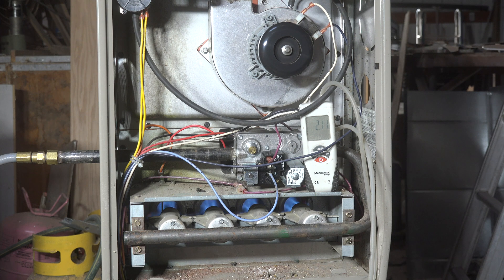If you look close there, you can see we're at about 2.10 inches water column. It didn't go up to the proper pressure — it should have been 3, and it's only at 2.10. So the regulator doesn't work correctly.